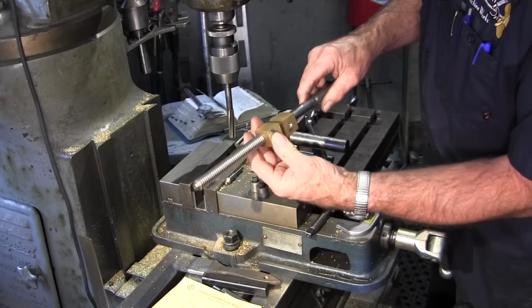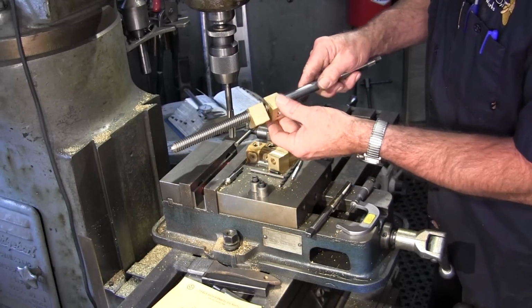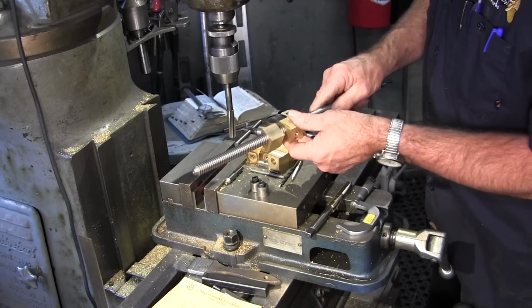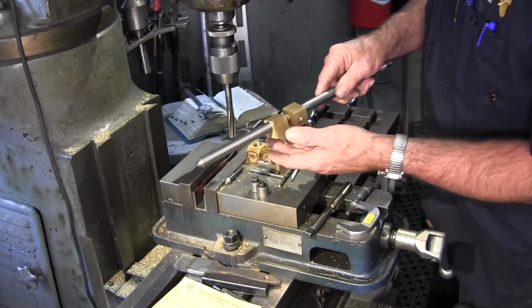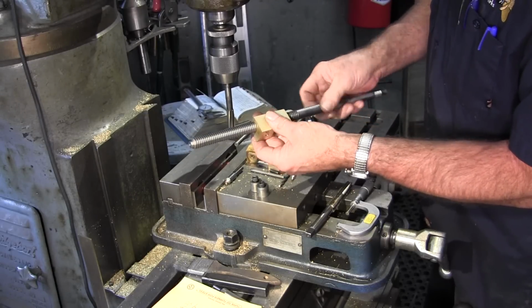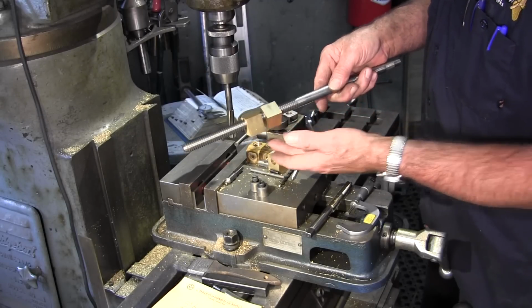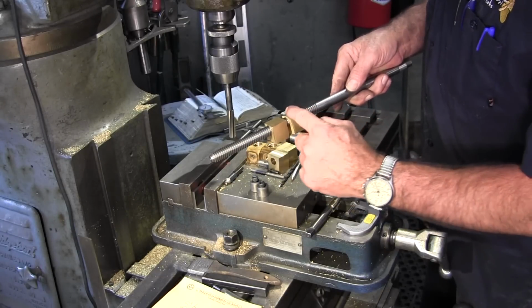This nut here is actually stuck on there, with a little bit of friction. It's not tight on there, but it won't rotate, and you can see how much this one here drops down. And if we take this one out to the same position that one was in, it does the same thing. Both nuts are exactly the same. It's just that we have wear from here on down.